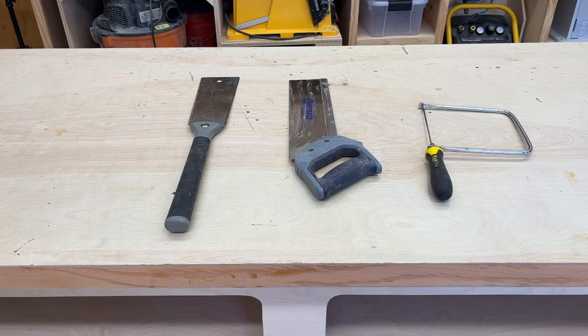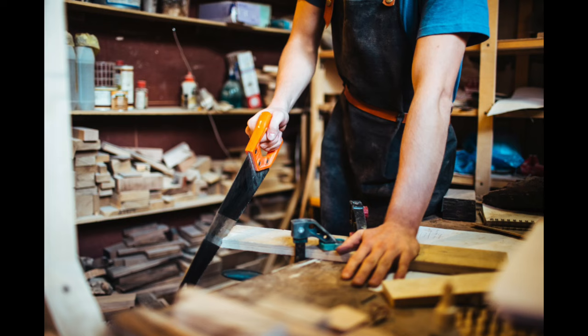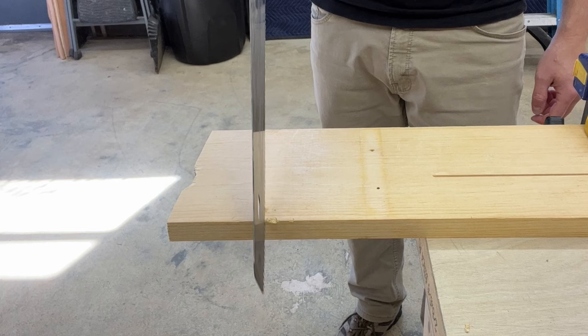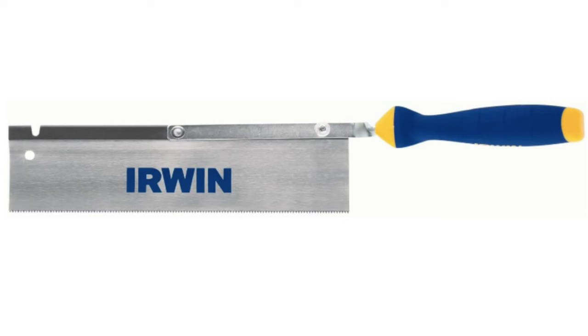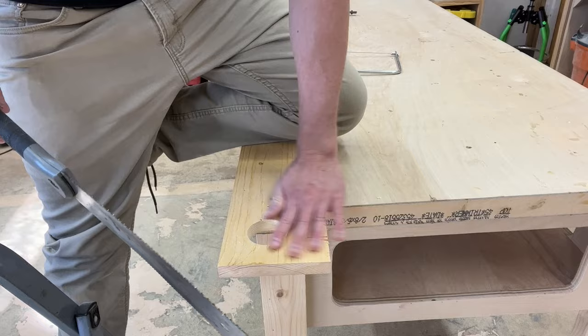Number two: sawing too close to your hand. I use hand saws on a lot of job sites, mostly to finish cuts, but I see people doing really dangerous things with them. The most common problem is keeping their free hand way too close to the blade work — pinning down the piece really close to the cut to keep it stable. Hand saws are actually less stable than power saws; you have to drive them with a lot of arm force, and especially when starting cuts, the blade can easily jump out and skip across the board. If your hand is nearby, you'll push a full stroke across it in a heartbeat. This is even more disastrous with fine-toothed woodworking saws, which are surgically sharp. Years ago I was notching a piece of oak flooring with a dovetail saw, had my bracing hand too far forward, and shot one stroke across my pinky — it almost took it off. Clamp down boards you're cutting, or brace with a knee like old school carpenters, but keep your free hand clear.